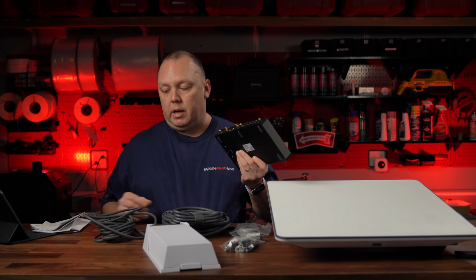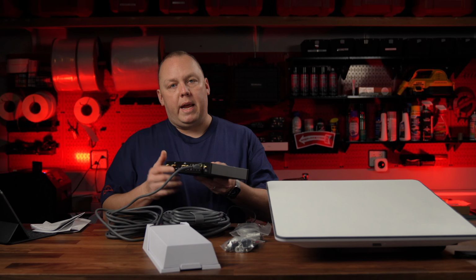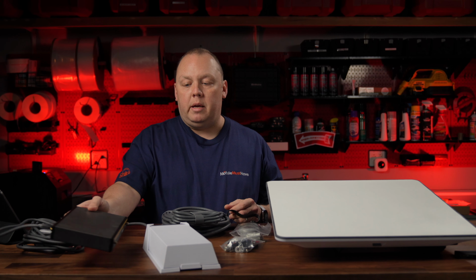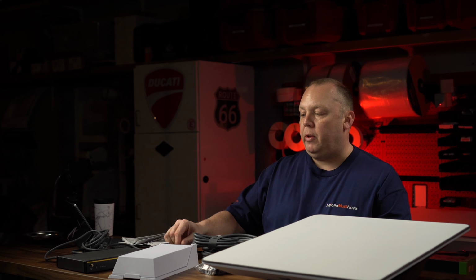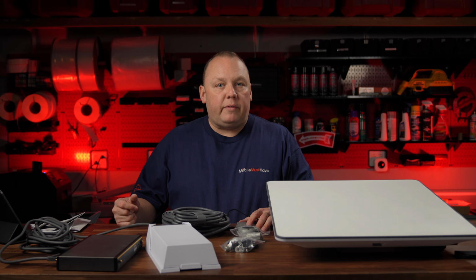This is a Balance 20X. I would take this cable and plug it right into the WAN internet input port, and that would be my internet solution. I get my 2.4 gigahertz, 5 gigahertz Wi-Fi out of the Peplink. This has an integrated cellular modem, so I could have cellular Wi-Fi, and then it would manage the Starlink for me, and I could combine Starlink and cellular into one solution, or just use it as Starlink only if I didn't have cellular